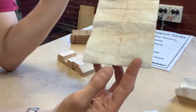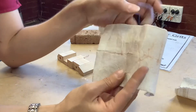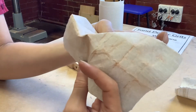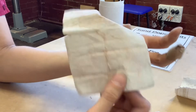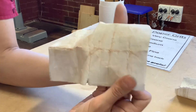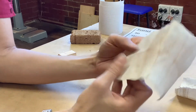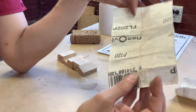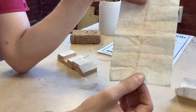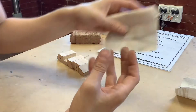This is another one to look out for — anything that looks like this or worse, with this many creases in it. We're starting to get bald patches where there's just no sandpaper left in the grooves and creases, reducing the efficiency significantly. You want to try and avoid using paper that looks like this as well. This one could just go in the bin — it's been very well used, it's done its job, it's time to throw it out. It's never going to give you the nice cut you need from a 120 grit sandpaper.